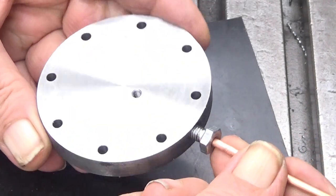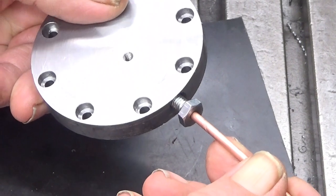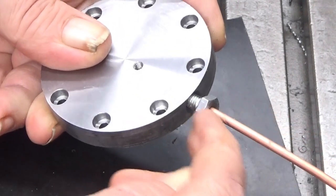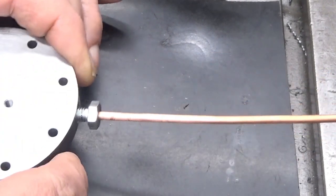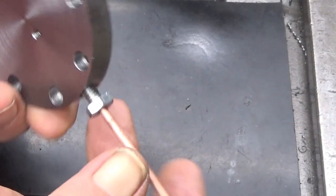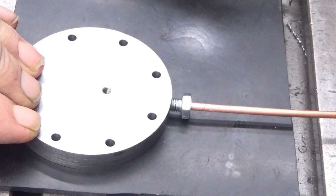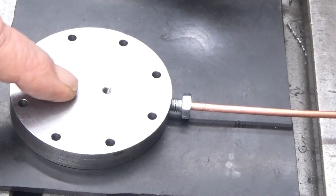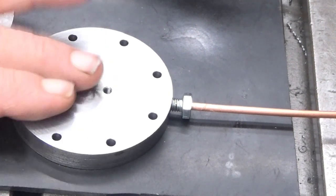Well, looks a little bit out of place, but okay. I'm really sure that this is tight now. It's tight. This is not the final tube, so we are going to test this. So the next thing is to make something else. We are making a key slot in the gear, one of the gears. We need a key slot there, and then we need to make the key and also a makeshift shaft, which I can use to test this pump.